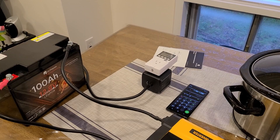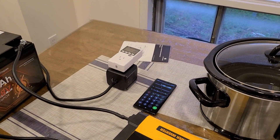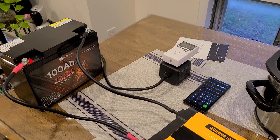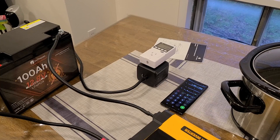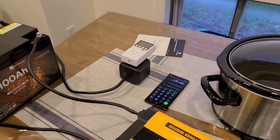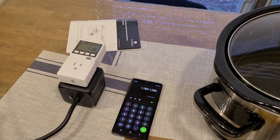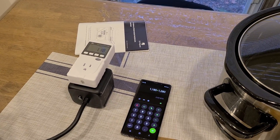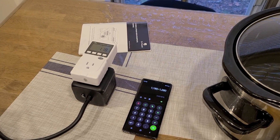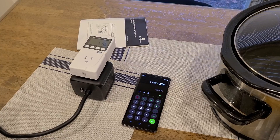Recording results a few days later: I ran the battery down to zero percent using the DeWalt inverter. I still don't know what happened when I plugged in the heater. With the crock pot, I got about 1180 watt hours AC capacity, giving about 92 percent AC capacity efficiency. That's a bit higher than other 100 amp hour brands — I've scored around 85 percent from Litime, Redodo, and Power Queen — so this one is a tad better.